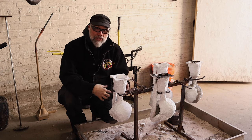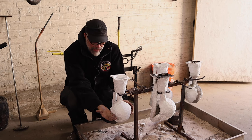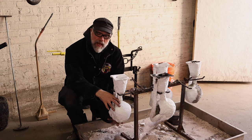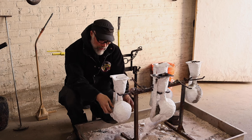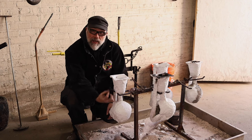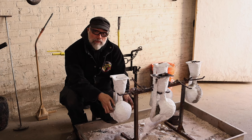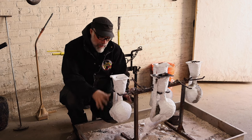That's another challenging thing when shells are buried in too much sand, or even worse, only buried halfway in sand — suddenly the top of your mold is cooling faster than the part encased in sand. As the metal cools, it's actually going to potentially pull metal from the hotter points, which could be from the cup — ideally where you want the metal pulling from — but it could also easily be pulling from your pattern. So if you are going to bury your pieces, bury them in their entirety.